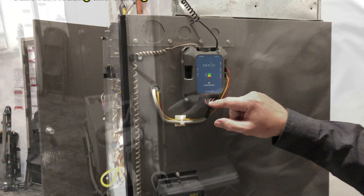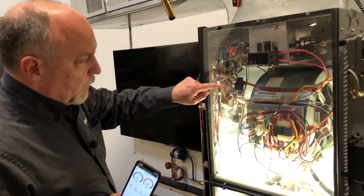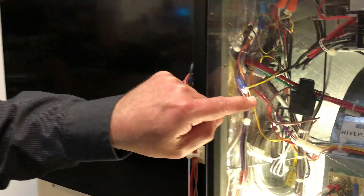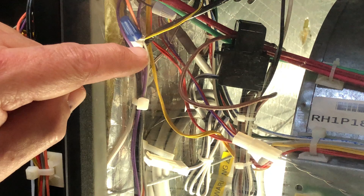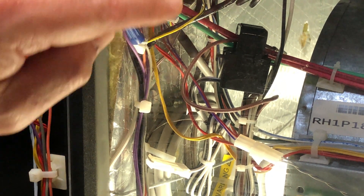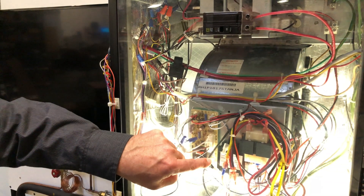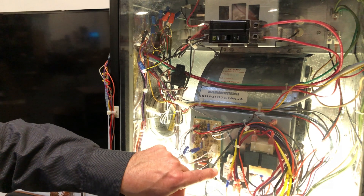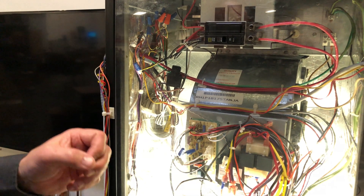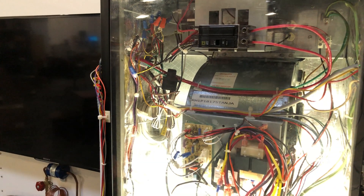Let me walk around and show you. Over here you can see we ran these wires out to a CT — a current transformer — inside here. All this CT is doing is watching the current that the air handler is drawing. We're also measuring the power coming into the air handler via a small transformer right down here, which measures the incoming power. So we're getting line voltage, we're getting calls, and we're getting the CT reading.